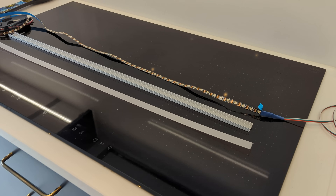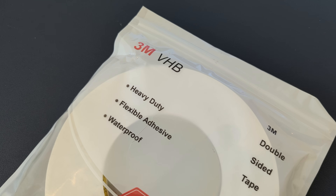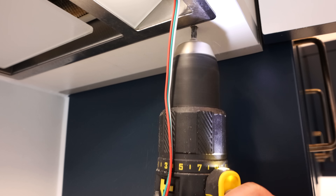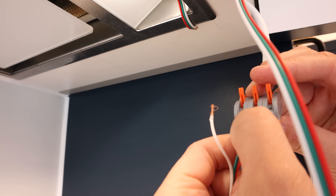That meant I could fit one of my LED strips into it, drill a hole through the cabinetry and run the cable up to the existing Quinled controller. I cut a piece of aluminium channel to the right size, fitted the LED strip into it, and stuck it up vertically into the perfectly sized recessed space with 3M VHB double-sided tape which is water and heat resistant. I then drilled a hole and ran the three core cable into place — all whilst my partner was away so she wouldn't freak out. Because it was such a short length of LED strip I wouldn't need to worry about any extra power injection.